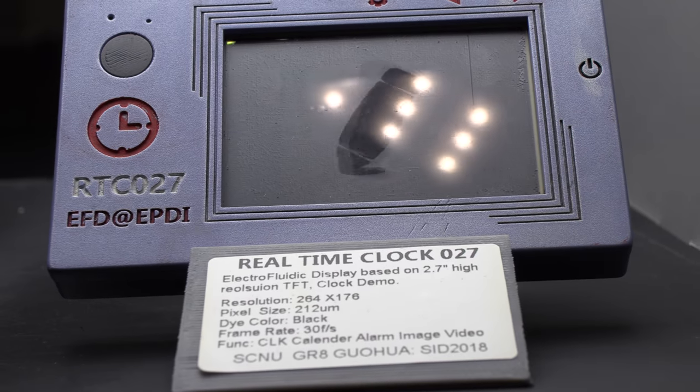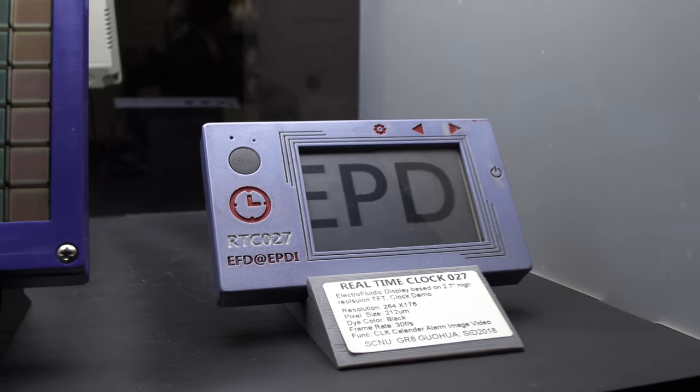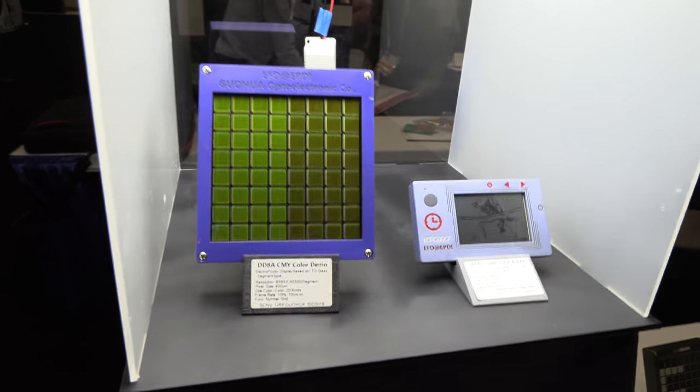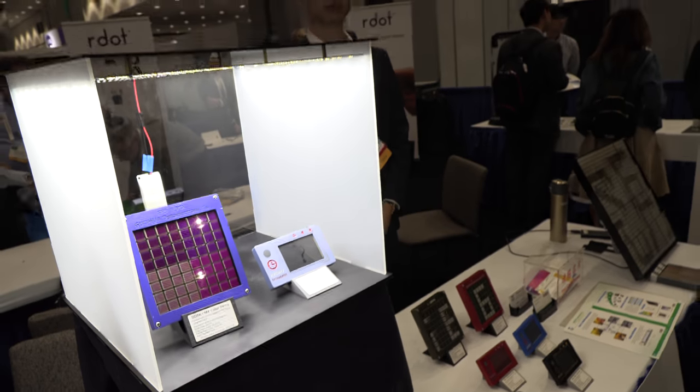Even the color display is capable of that resolution. The limitation is that they don't have the funds or possibilities to design the transparent TFT display necessary for the three-layer system. The segmented squares are actually clusters of 625 small pixels linked together by the same electrode.